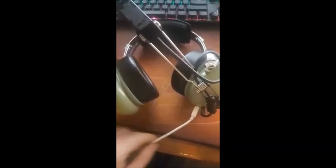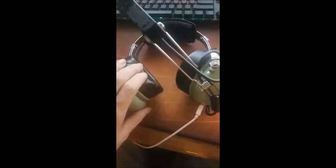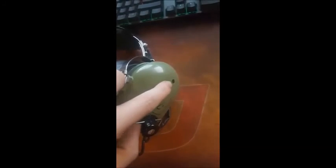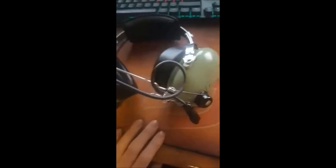Here we are - gone with the wire because it's a lot easier and I don't have another Bluetooth module. 53mm drivers from the last ones I put in, got these pads from those headphones, and it's a removable cable and infinitely adjustable. I intend on adding volume control through here so it's adjustable, but it's completely usable and works really well. The mic has been nice and clear. That's it for this update - I'll probably add a bit extra when I do some work with the volume control.